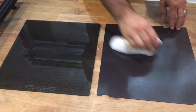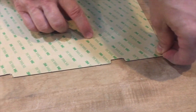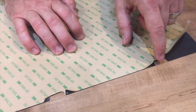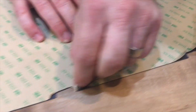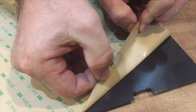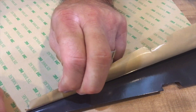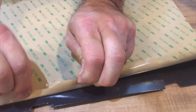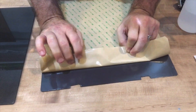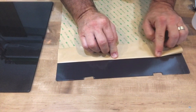Next I want to get my magnetic bed, turn it over, and pull up my 3M tape evenly for about one inch or 30 millimeter strip. Where it was cut out, you have the risk of the paper tearing when pulling it off, so I like to pre-lift up all the corners. I start to peel it back — do not touch the 3M while you're doing this. I like to pull it back a generous one to one and a half inches, 30 to 40 millimeters. I expose a nice even portion of the 3M and crease my backing paper nice and cleanly.